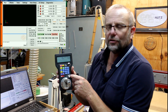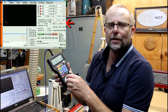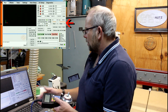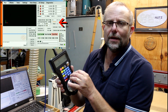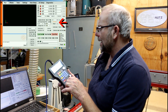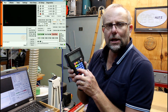There's a spindle override selector. If I turn the spindle on and wind the MPG, I can increase or decrease the spindle speed. You'll see on screen that the percentage goes up and down for the spindle. Likewise, if I set this to feed rate and turn the dial, my feed rate percentage goes up and down, so I can adjust the speed on the fly.